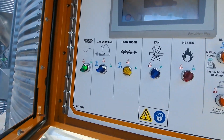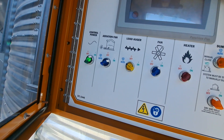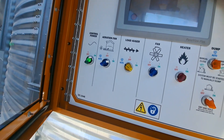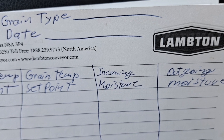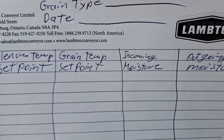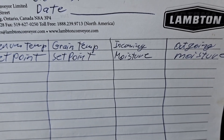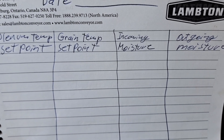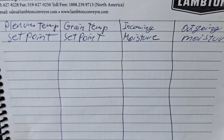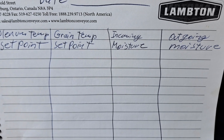For setting the grain temperatures, we started here with a 140-degree plenum and a 97-degree grain on barley. With drying grain that you want to use for malting or seed — if the grain has to be sprouting quality — you're not going to want to run your plenum temperature much over about 110 degrees or else you could damage the germ. With corn you would run 180 plenum and start with a 120-degree grain temperature. Start the dryer and let it go through three dump cycles.